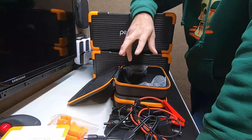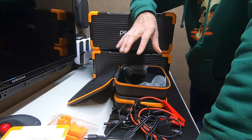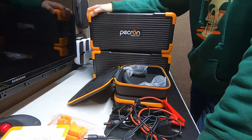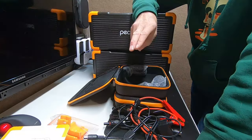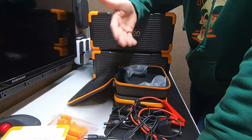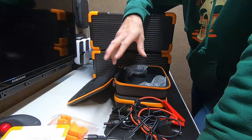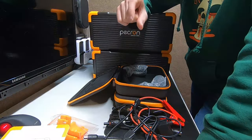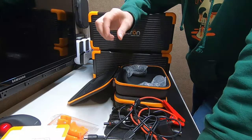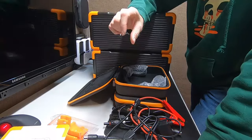And the second thing is, people don't understand that you could have voltage spikes, okay? So if this is a 95-volt system and you put in two panels, and let's say, just for argument's sake, they were 94 volts open circuit in series, you have literally 1 volt of safety margin, which is called headroom in the music industry. That's extra power that you can go above your max in case you need that extra push.